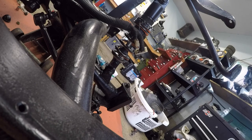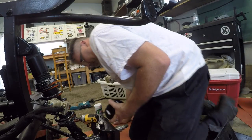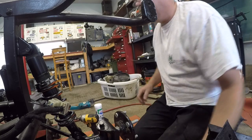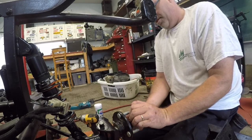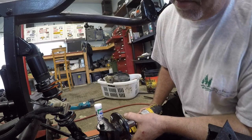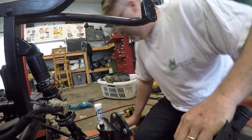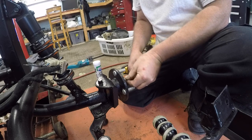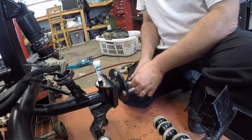This shaft over here has a little wear in her, so I'm gonna have to put a little bit of weld on the old shaft to tighten her up. Engine parts are in too - I'll pick them up tomorrow. We should be able to slide this one on - this one might need a little tap because it's still pretty good. I'll throw the nut on to help it all the way on. There it is - just back her off until she's good. Now we'll make ourselves another cotter pin - fold her over, bend her over, slide her through and bend her over.